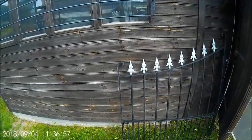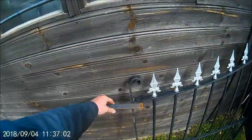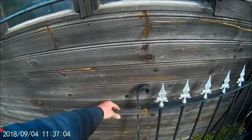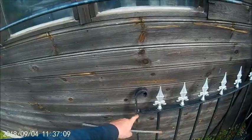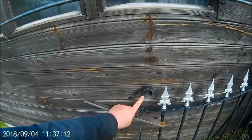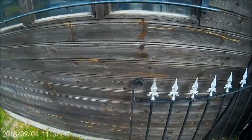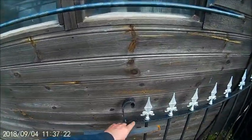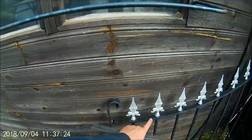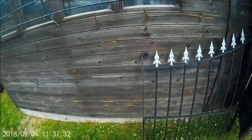So what I'm doing is cutting it down there, and then adding 370mm in, which will add 3 bars, and then welding that bit back on, so that will make it just over 10 foot wide. I was going to go exactly a foot, but it makes it awkward. That would be longer on one of them, so if I do exactly 3, that gives it the right amount. So I'll show you how.